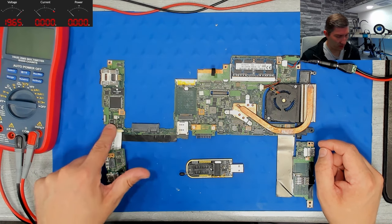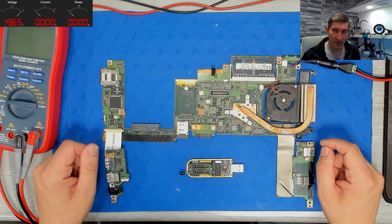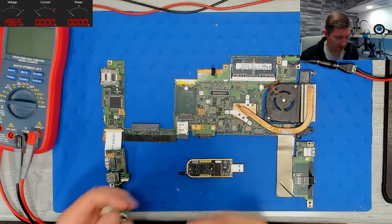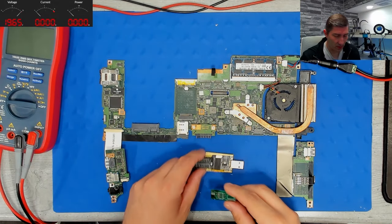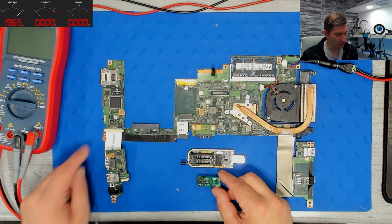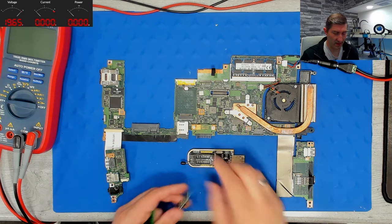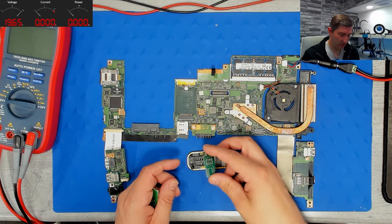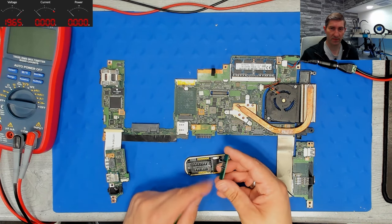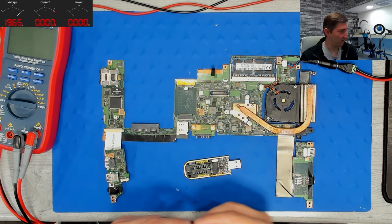So we need the programmer. But how can we connect the chip to the programmer? Well, there are various methods, and let us clarify the cons and the pros. The first: this programmer usually comes with some small boards like that, and the purpose of these boards is that you remove the BIOS chip from the motherboard and solder it here, and then you can simply plug it into the programmer. Here we have the pins, so you can simply insert it into the programmer. First method.